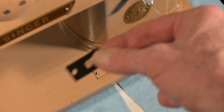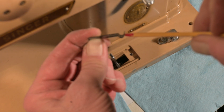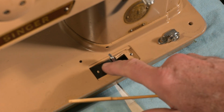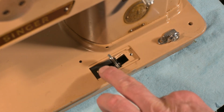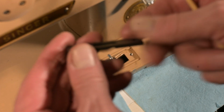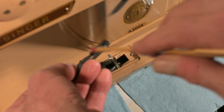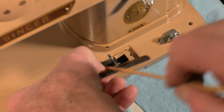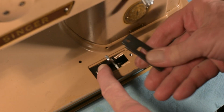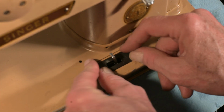This is how it is assembled. First I take the short spring, and when you look at it from a side aspect, we see that there is a hollow, a U shape, and that's where the bottom of the lever is going to go in there. So just put that in there and let the lever sit in there like that. The screw will go through there after we get the other parts. So now we've got the bottom spring, or the bottom plate, and the lever, and now we've got the top plate, or the top spring, and likewise it has a flat side and it has a side with a bump hollowed in. And the hollowed in side goes down. We want the flush side, the flat top, on top. So I just want to line up my lever like that and hold that while I pivot this on, like that. So that feels weird, but that's okay.